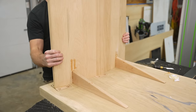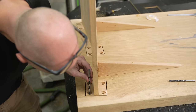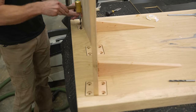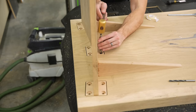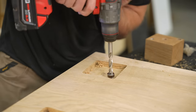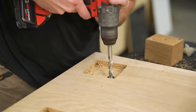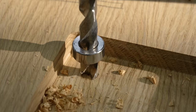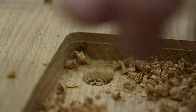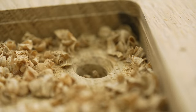If there is one tool I continue to misuse that infuriates a small cross-section of my audience, it's using a brad point drill bit to mark spots for threaded inserts instead of a transfer punch. For the life of me I can't figure out what's wrong with it — I think the pushback comes from metalworking, where using that on metal would break the drill bit. But it just keeps working, so I'm probably going to keep doing it.